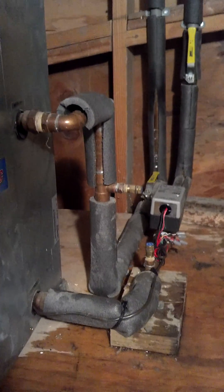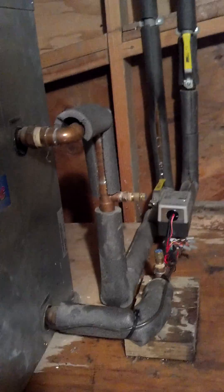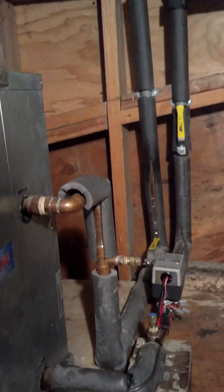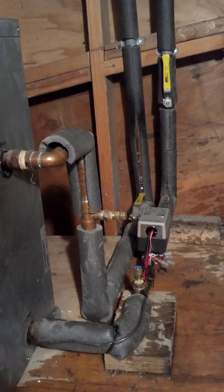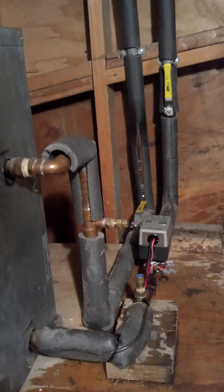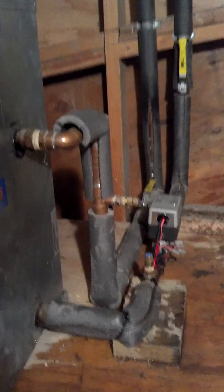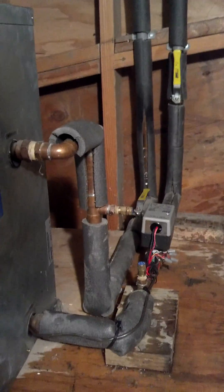As you can see, there are Pete's ports on these units already. After I get everything going, I will double check my pressure drop across this unit to make sure everything is good to go. The previous installer had put some ball valve isolation valves in there, so if need be, I can shut off or open up the loop side. And if I do have too much water pressure, I can choke it down some. But better to have too much than too little.